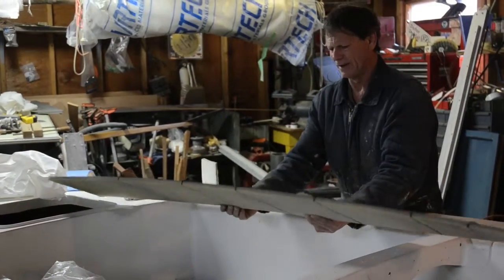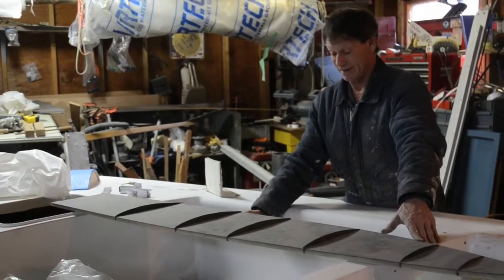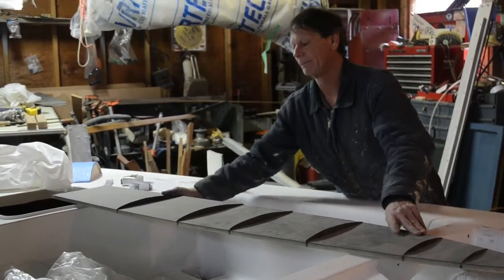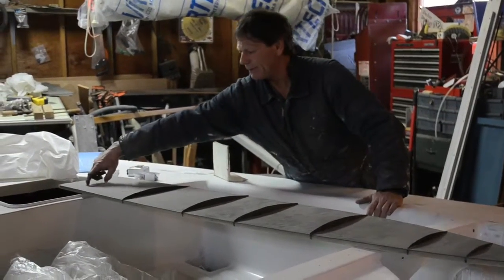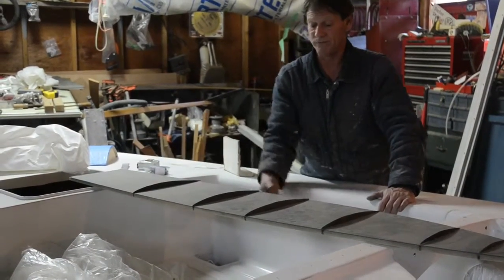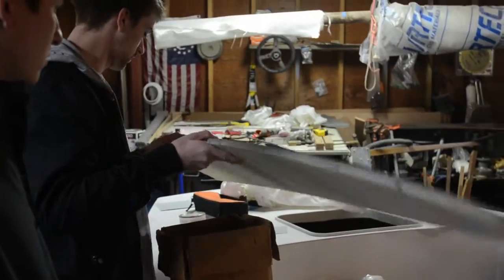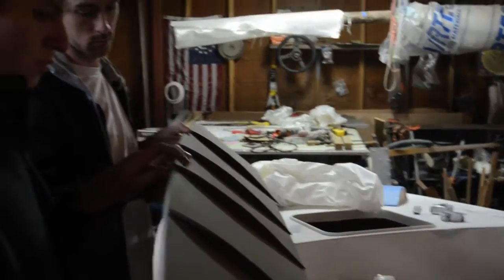So when this thing is all done, it's actually going to have little tip deflection, which is kind of a pain in the neck, because it really increases the load here. They want some tip deflection so you don't have too much moment here. And a post like that might be sitting in here all the way up, but this particular one gets mounted on the back of the boat, so it won't have a post embedded in it. It'll have close to 5 feet in the water.